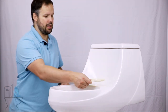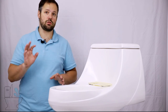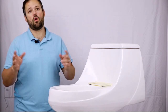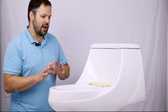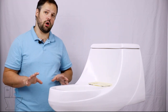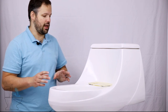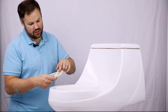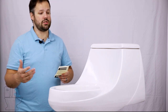French Curve toilets — depending on the curve in the back — some will work with the Cascade 3000, and it would also work with the Blooming or the Galaxy. So there are three seats on the market that French Curve toilets can be paired with. The Cascade is our pick for a variety of reasons — visit our website and live chat with us to learn more. But not all French Curve toilets are created the same, so this curve may be shallower or steeper, and even the Cascade may not fit every toilet. If it's really close, like with the Jacuzzi Primo, you may find yourself cutting out a little bit of the mounting plate, which does work — we've had customers do it successfully — or you may find yourself needing to replace the toilet.